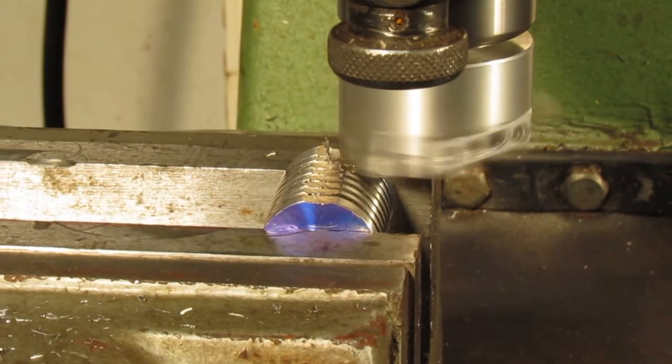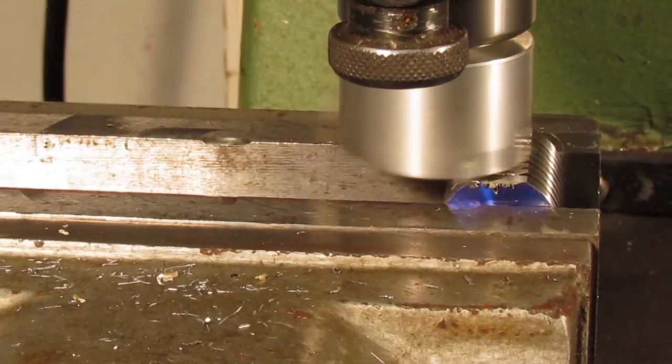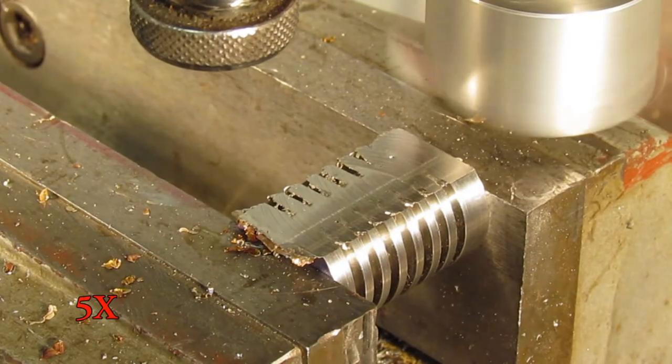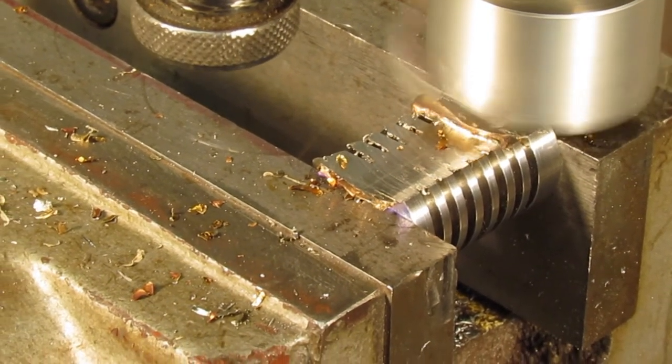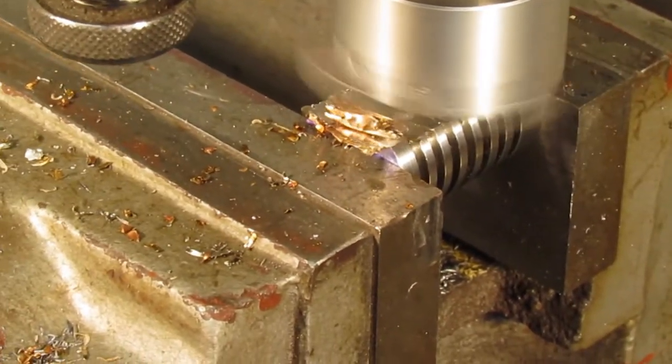Now it was time to mill the flat face on the cylinder. I chose to use a fly cutter as I knew that using an end mill on stainless steel would likely ruin the end mill. Also, I have the means to sharpen the carbide tool, so it made more sense. After removing most of the material, it was very apparent that the tool bit needed sharpening. Once sharpened, the last few cuts were light passes of 0.001 of an inch depth of cut.